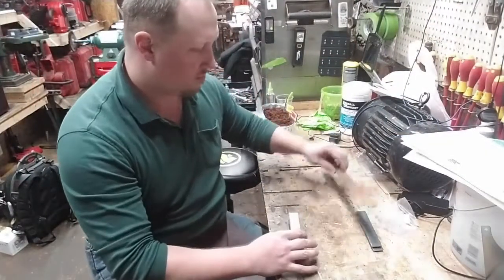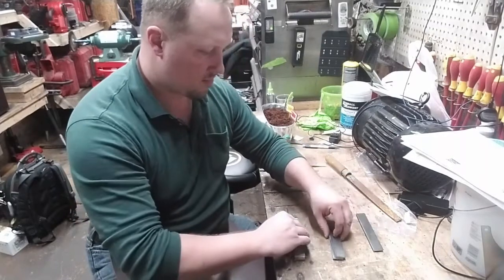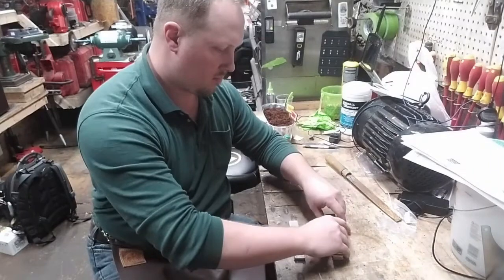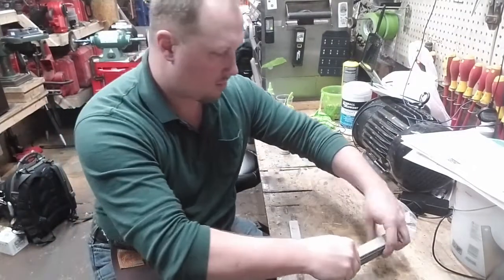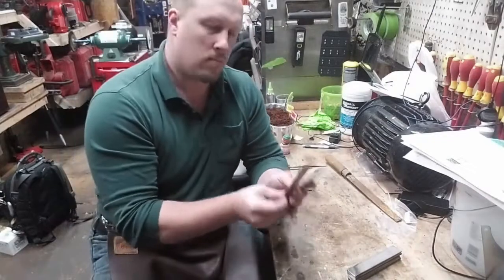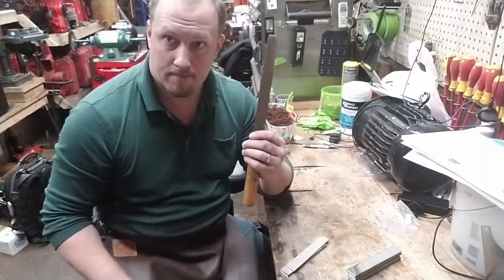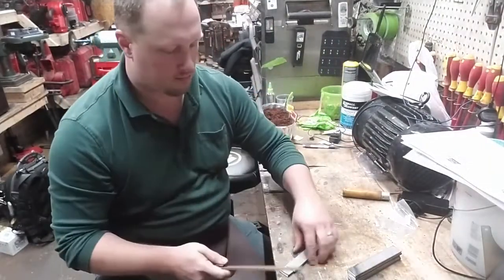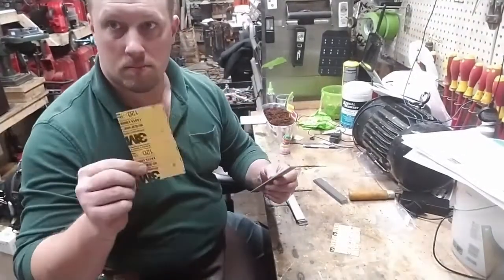We're back in the shop with tonight's project. I'm Reinhold von Gleer, and what you're looking at is some of the steel we made last week. The bright colored steel is the steel that we created, high carbon steel from mild steel through the process of cementation or carburization. And what we have is the material for a Norwegian Seax. That's going to be tonight's project. And we'll see how far we get.